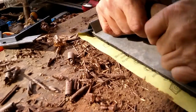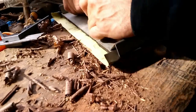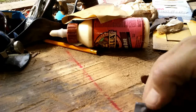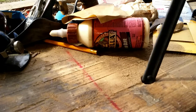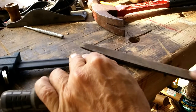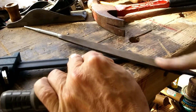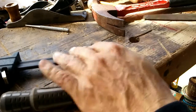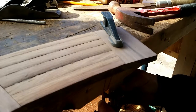When I started sanding, I discovered I needed a better way to hold the trivet to the bench, and that the bars on my quick release bar clamps fit into my bench dog holes. So I filed off the stop at the end of the bar, removed the movable jaw, slid the bar clamp into the bench dog hole, and moved the movable jaw back up the bar — and suddenly I have a hold-down.